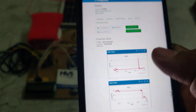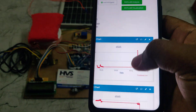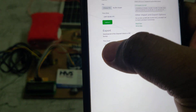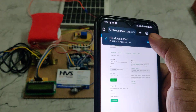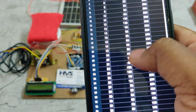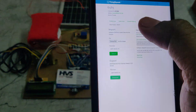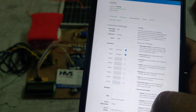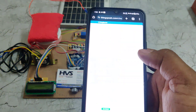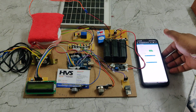After configuring the hotspot, log in to the ThingSpeak cloud platform where you can see channel 6565 with previous data showing gas in PPM and air quality in PPM. Before erasing, take a data backup via data import/export — it downloads as an Excel sheet showing date, time, entry ID, and number of samples collected. Then go to channel settings and select 'Clear Channel' only, so you can access fresh data on the private view.